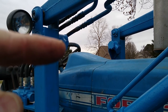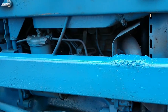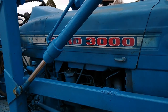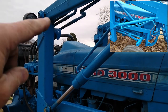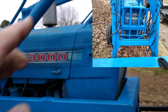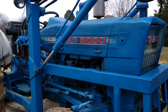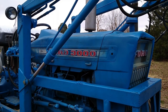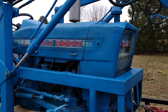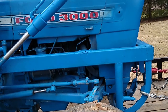I made a cut here and you can see the little cap that I welded on there. I'll superimpose a picture so you can see it — I had a brace that came from there down to there and then back up to the end, capped over the tractor and went over to the other side. I really didn't need those, since this lift was made for a 600 to 800 series tractor. It hit the end cap of the tractor and sometimes moved it so much that it would move the fan shroud, and my fan blade would get into it — so I cut it off.